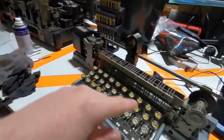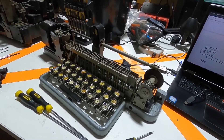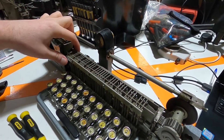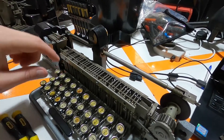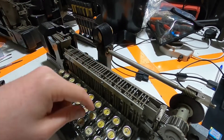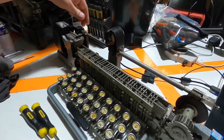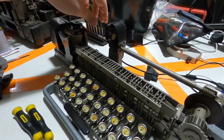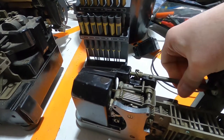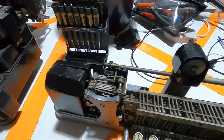This section comes off - there were just two screws that held it onto the rest of the teleprinter. Each of these keys has a locking bar at the back. This locking bar would go out and then you can press a key, which makes that go down. The locking bar comes in so that none of the other keys can be pressed whilst that one is down. Then the cam would spin round, and we haven't fully worked out yet what it does - we haven't dismantled all this bit yet. It runs a bunch of cams and they go to each of these five levers.